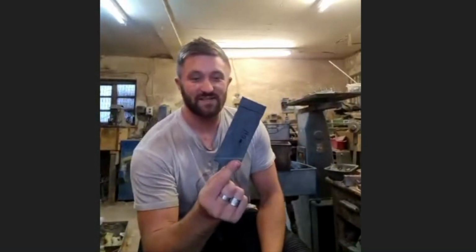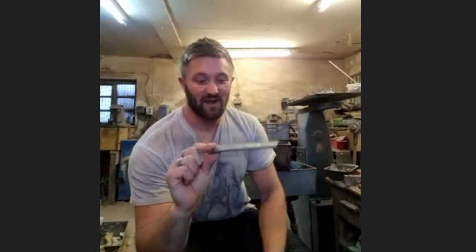That's as close to forging as I get, really, because I've got big furnaces and things like that, but our firm isn't kitted up for that kind of stuff. I just buy my Damascus in from other people who forge it themselves and sell it as billets, because that's easier for me. I get it as a forged piece of rough scabby steel, whatever length bar they send me, as a bent up piece. I skim it all flat, do all the annealing and normalizing, and then treat it as a piece of ground steel stock. So I do everything minus forging, essentially.